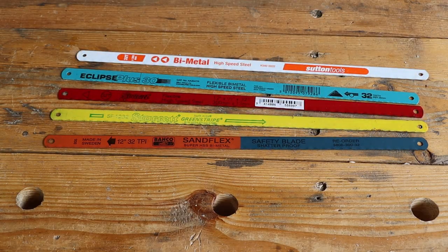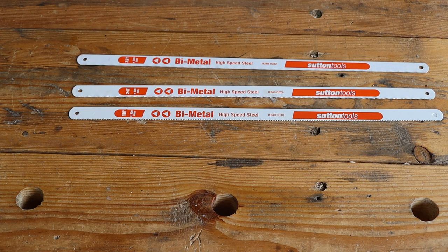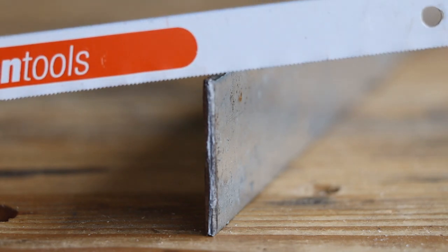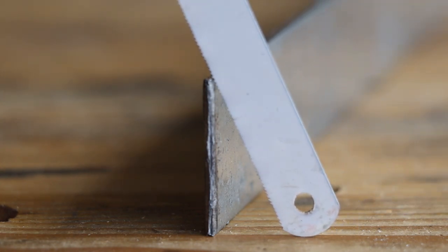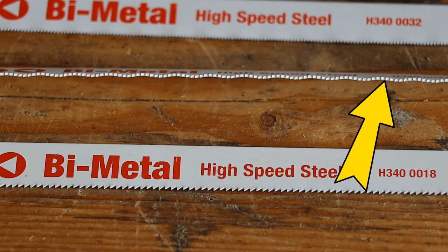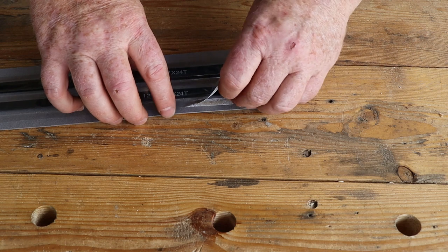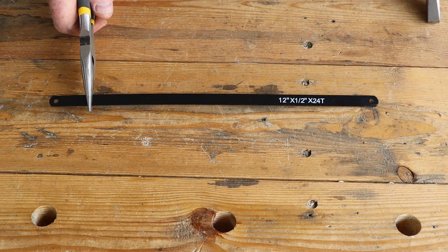So now let's talk about hacksaw blades. Hacksaw blades for handsaws are usually available in 18, 24 and 32 teeth per inch pitches. Coarse 18 TPI blades are used for thick metal sections like our wing nut; fine 32 TPI blades are used for cutting sheet metal and thin wall tubes. You need to match the blade to the material you're cutting — ideally you want to keep at least three teeth in contact with the material. If you don't have a blade with small enough teeth to achieve that, sometimes you can get the same effect by tilting the saw at an angle to the workpiece. Unlike saws for cutting wood, the teeth of a hacksaw are set in a wavy pattern — this helps prevent the teeth from getting wedged in the cut and breaking off. The very cheapest hacksaw blades are made from carbon steel, costing about 30 cents each. These blades are fine for cutting wood, plastic, or softer metals like brass and aluminium, but they wear out quickly if you use them to cut steel and are relatively soft.